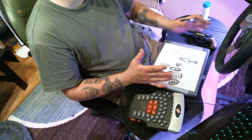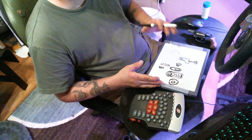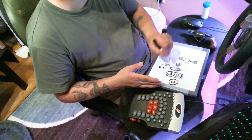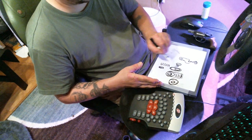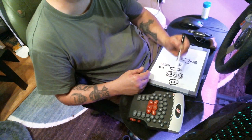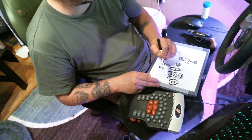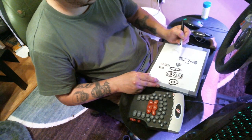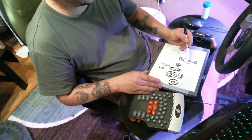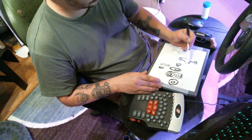So you've got all these pieces and you're wondering how to get them back together so the gun functions. You'll be fiddling with these three pieces — the washer, the assembly, and the screw. Here's how it works: the circle washer goes on the bottom. Get this assembly put inside the gun — it only goes one way. Go ahead and thread the screw in just enough to hold it in place, not all the way in, so it still has a little room to move.